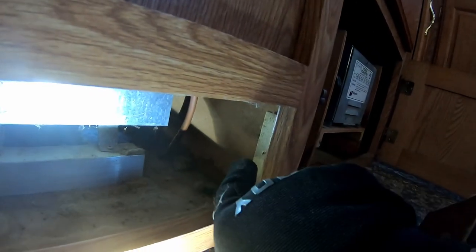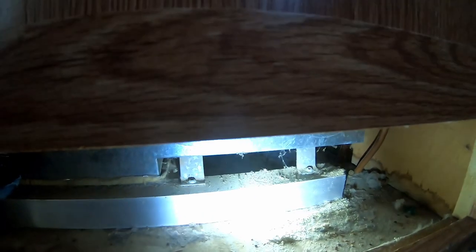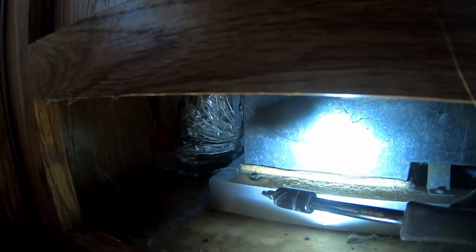All right, this mess got a little more complicated. Under the stove was an access panel. And there's a screw here, and then one on the opposite side over here. And you've got to take that panel out, and then there are screws underneath the cabinet under the stove here, here, that hold the thing in. And you've got to undo this duct work.